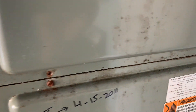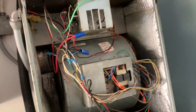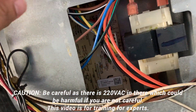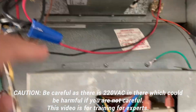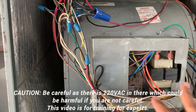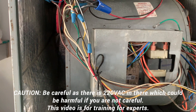There are four screws I removed and we're just going to lift this panel. You're going to notice a lot of suction. The main circuit board is right here and everything is behind this circuitry. Now you have to be careful — there's 220 volts coming right here, all of this is energized.